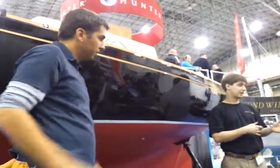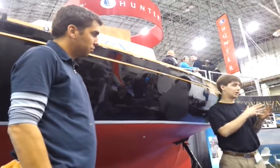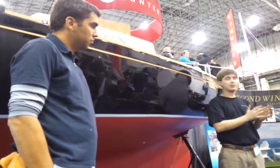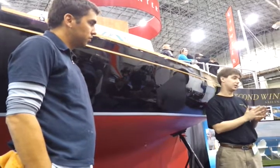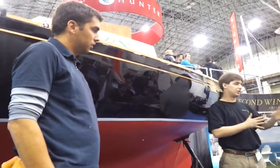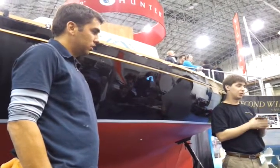Your heavily oxidized hull itself, right? We're starting out with the most aggressive, that would be the sandpaper. But it's doing the same thing that he's talking about. We're just trying to polish it at the surface. So keep it very wet, keep it moving, do large areas, different directions all the time. That's it by hand.